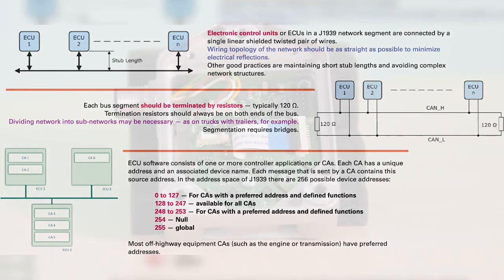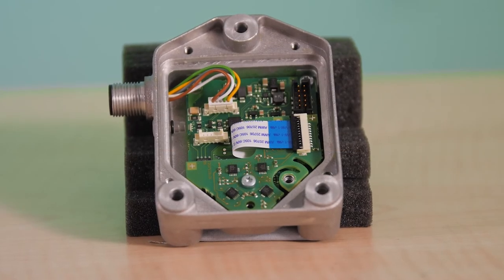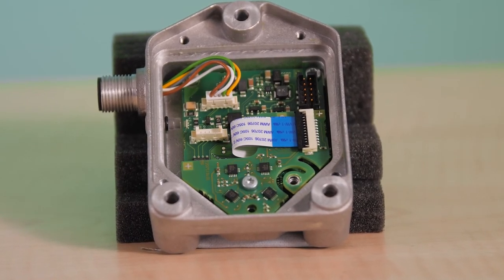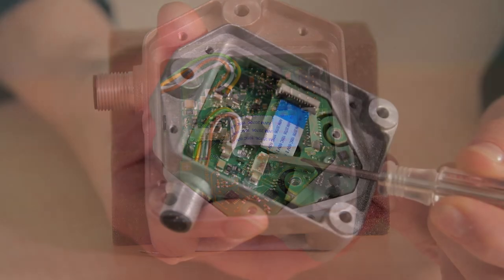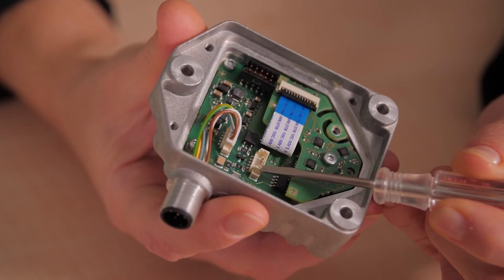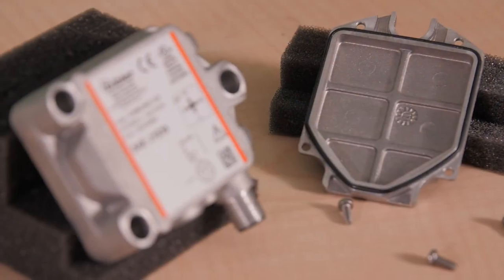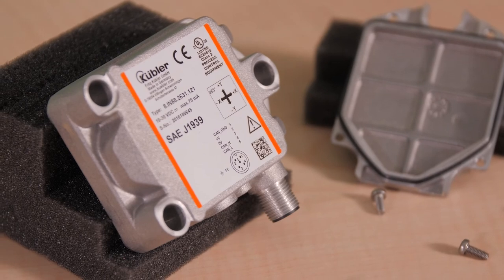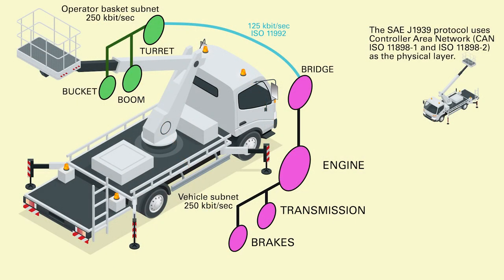The J1939 compatible IN88 is just one in an extensive product line from Kubler, all with different connectivity and performance values. The IN88s maintain resolution to 0.01 degrees and plus or minus 0.2 degrees accuracy in one-dimension variations, or plus or minus 0.4 degrees from the two-dimension sample detailed here. That accuracy remains stable over the whole life of the component thanks to the sensor array technique.